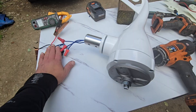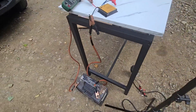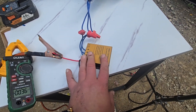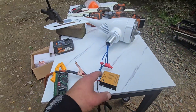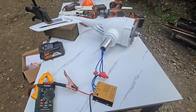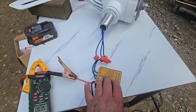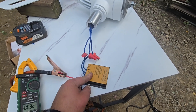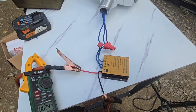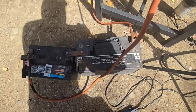Nothing is warm except the regulator rectifier - it's already a little warmer just from that little bit of generation. I would guess that this regulator rectifier is very inefficient, so I might look into better options for this unit. A big note from the instructions: it only recommends connecting to AGM or lead acid batteries, not lithium. If you hook these up to lithium, make sure you have protection for your BMS. There's probably a weird output characteristic that could potentially damage lithium batteries - maybe a low-pass filter with a capacitor and inductor between the rectifier and the battery.